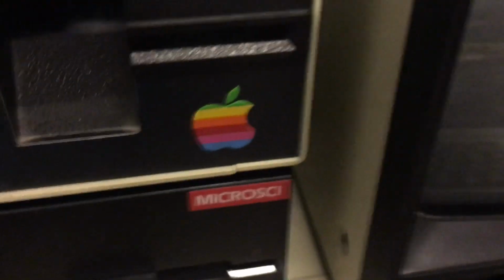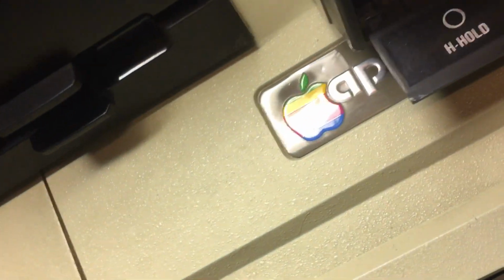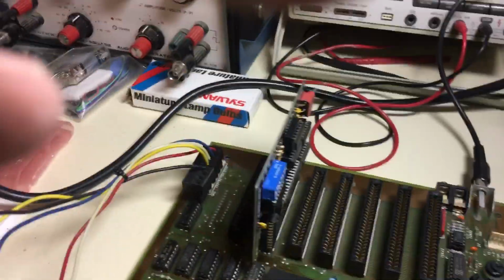What that other switch does is bring you into some strange portion of the ROM, which I don't think I programmed. All right, so let's see here. I've got to flip dip switch 2. Put some light on the subject here. All right, dip switch 2. We'll flip it there. That should choose the AppleSoft ROM. Put it back in. So we've got it back in there. And let's see what happens. There it is, Apple II with the AppleSoft prompt.